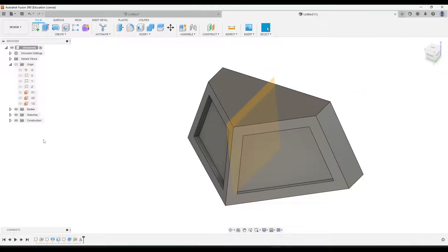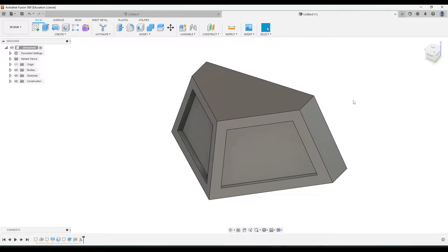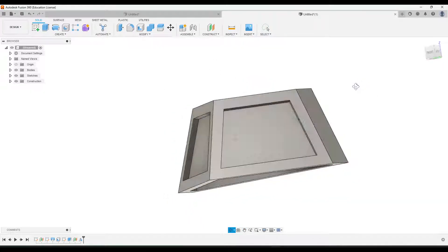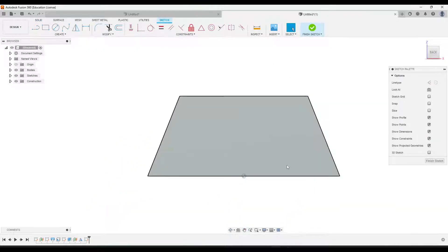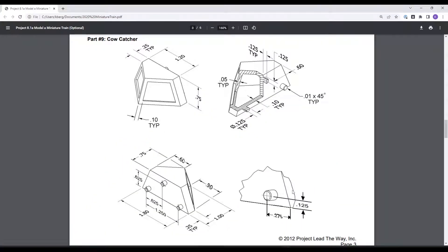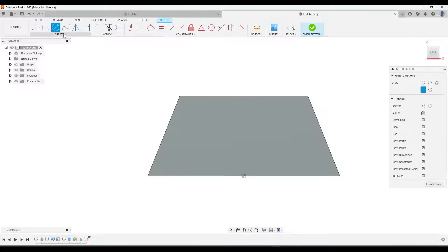You'll notice the other side is done now. Let's go ahead and hide this plane — just click the eyeball under Plane 2. Then collapse those because we won't need them anymore. The last thing we need to add is the connector pegs on the back. I'll click the back face and create a sketch. The back has three pegs and their size is 0.125, so let's go ahead and place them roughly where they need to be — they are 0.125 in diameter.